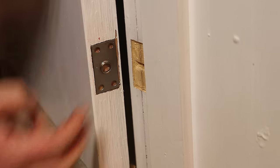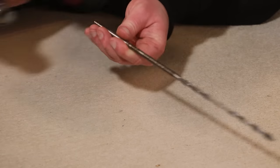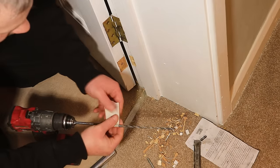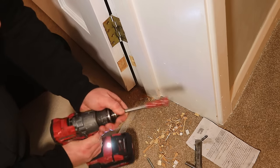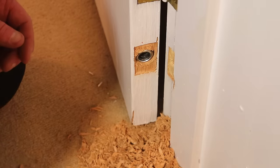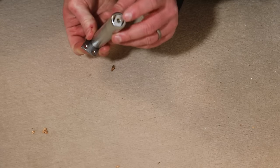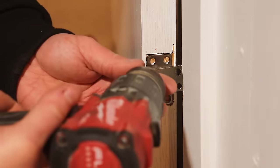As you can see the plate fits nicely — I'll just have to touch that up later. At this point I'm just going to mark out my center hole and drill a pilot hole first using this very long 6 mil bit. It doesn't have to be this long; the only reason I'm using a long one is because it makes it easier to see when you're drilling straight. I'm going to mask up the drill bit with masking tape so I know I'm drilling to the correct depth — 150 millimeters. I can then rotate the back plate to give me space to drill out the pilot holes for the screws.